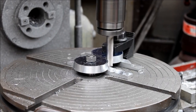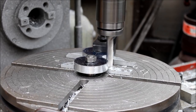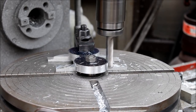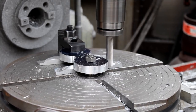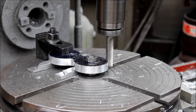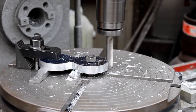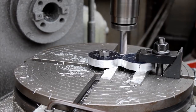We've gone around now a few cuts to get it off - that last one was about the 20th pass. It ends up with a few little ripples in it, but by the time you've rubbed it and polished it - just gone around it with a deburr and a file and polished - it just takes that sharp edge off. So now we can start to see that figure-of-eight shape. It's getting the cutter to run in so when it comes round it ends up just like a nice little loop.